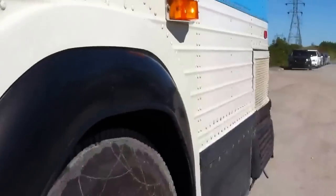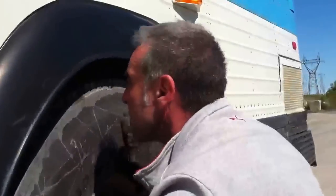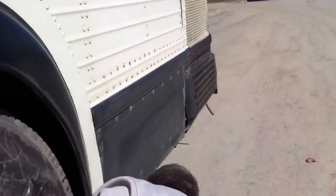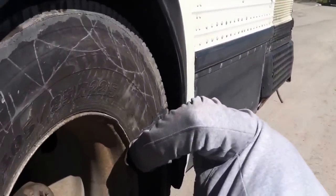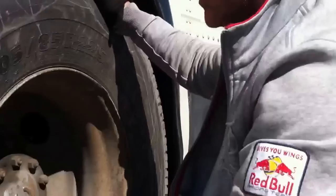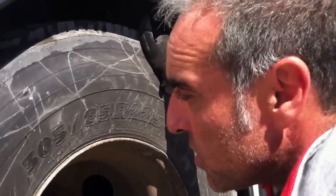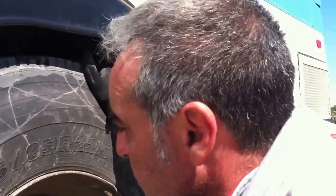As we check the inner tire first, both tires present no foreign bodies lodged in them. As we do the turnaround, we see that the tires are intact and the wall of the tire is also in good condition. If one of the two tires presents a foreign body, it will be a minor defect. If both tires present a foreign body, it will be a major defect.